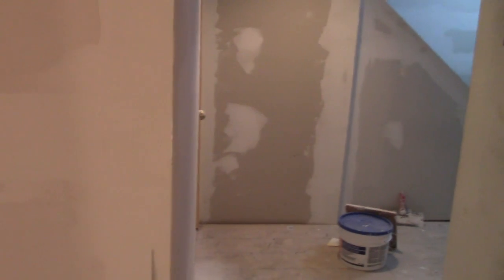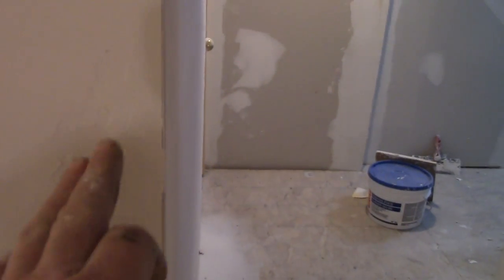Alrighty. Now if you can see that, I've got my sanding done on the first go around. Most of it anyway. It's getting there. You can see I sanded it down, and you can see these spots where it needs a little more, and it's just like doing Bondo work, really. You'll see where the tape is showing through. It's a little high spots and then a little low spots. So it's sanded now, and I'll give it a nice skim over top the whole thing. And yeah, metal edges, sand them down right to the edge.